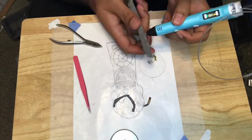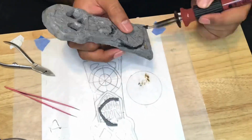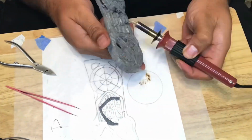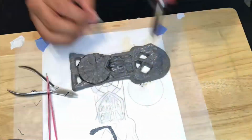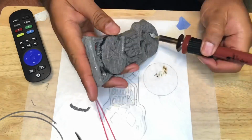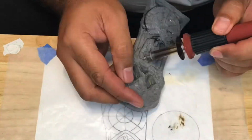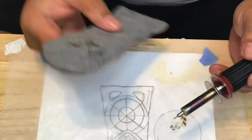After getting all the teeth in place, it was just a matter of using the soldering tip of the wood burning tool to sculpt and shape the draft in between them and along the inside edge of the mouth. Then it became a matter of cleaning it up and trying to give it a specific texture and look for the metal casting.